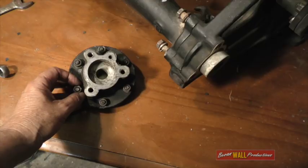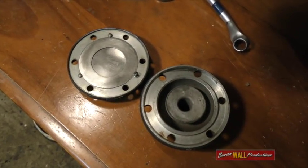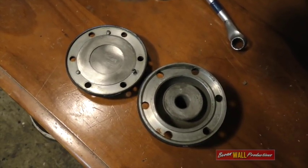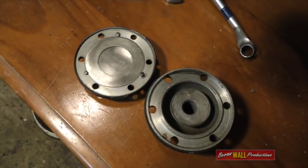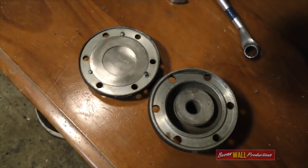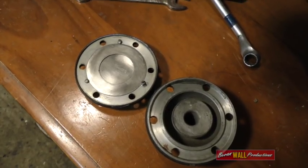Let's pull this one apart and see what's inside. This is what's on the inside of an S type diaphragm chamber. The first thing to check is that it's clean and not blocked. In some of the ones I've opened up in the last few days, I've found the remains of insects, lots of soot and dust, and that sort of forms into a cement that stops the discs from vibrating.